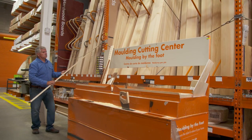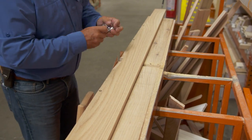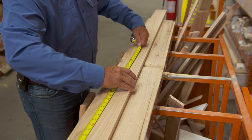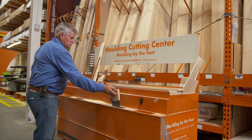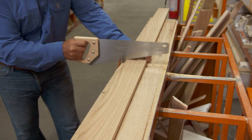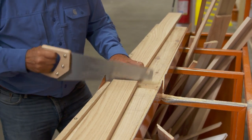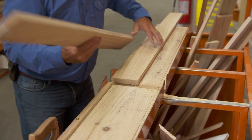We'll also use quarter-inch birch for the back — they didn't have it in oak, but you won't really see it since I'll stain it. And then some solid stock as well: one-by-four red oak and one-by-three red oak. The nice thing about this is you can buy just what you need. That solid stock is for the face frame to cover the edge of the plywood and simulate a drawer front underneath the table.